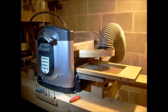Time to make some sawdust. I've got my project board loaded on a sled, and that's going to feed through the machine something like a planer, although it's going to feed much more slowly. This operation is a raster carve using a tapered 1/16th inch diameter ball nose bit.